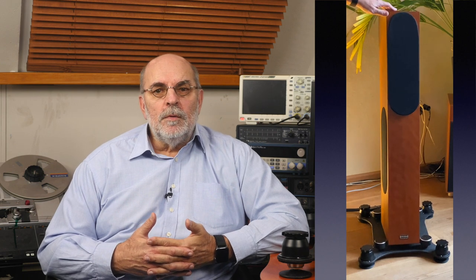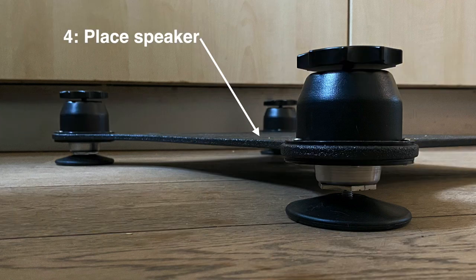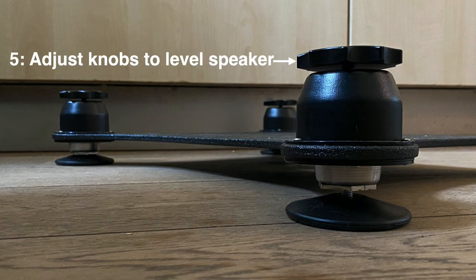When the speaker is placed on the podium, you will notice some vertical movement. When stable, the podium should not touch the bottom. It should be supported by the springs only and thus move free to some degree. If not, you should turn the adjustment knobs counterclockwise until they come free. If the front two springs touch the bottom, turn only the knobs on the front counterclockwise, and vice versa. Never turn all 4 knobs in one go. Do the front first and then, when needed, the rear knobs.